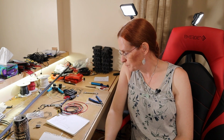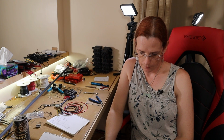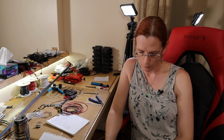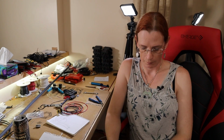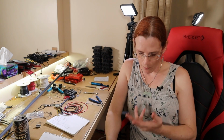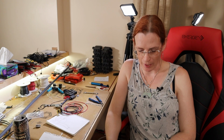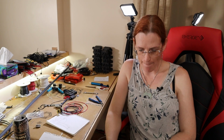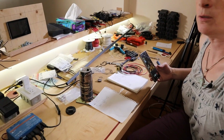Yeah, and I think what probably happened, you said the screen came on and went off and came back on again. Yes. So what I think probably happened is that it partially failed when it went below ground. It caused some of the electrolyte to break down, and then when the voltage went almost back up to its working voltage, it came back alive. Now it's already broken down a little bit inside. Now it starts to get hot, and over the next minute or so, which would be why I saw 30 seconds to a minute before I heard the pop. It's overheating. Yep. Now some pressure's building up, because I'm boiling the electrolyte. The electrolyte's starting to boil and get hot, and gas is building up in there, and all of a sudden, pop!